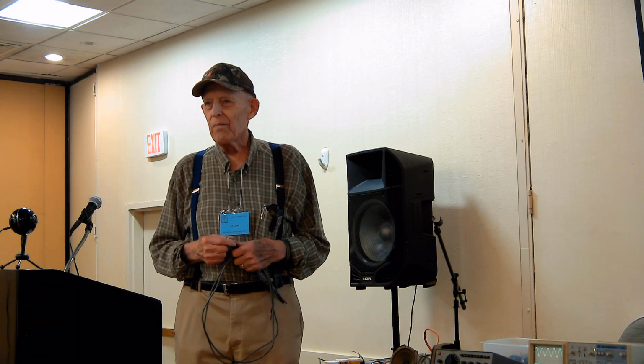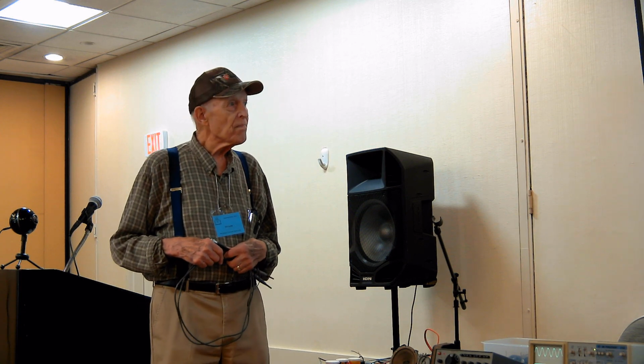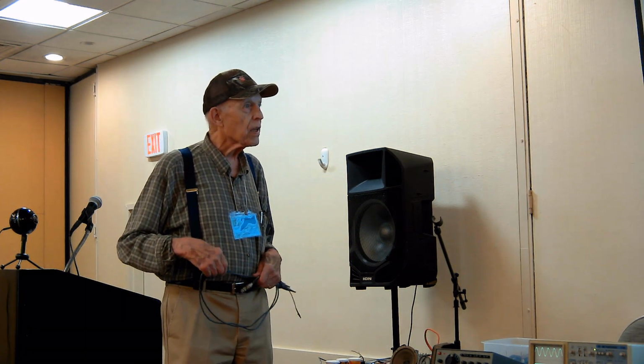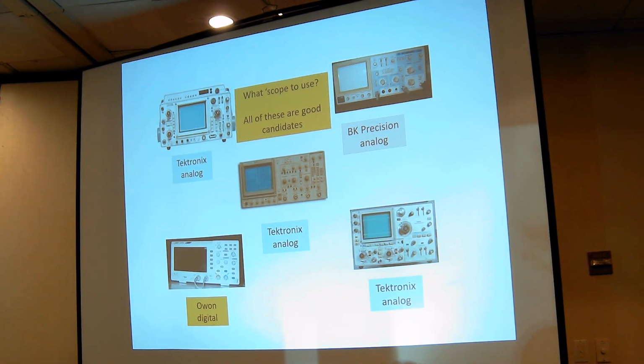Okay. Ed, I noticed on that slide, can you bring up the slide again, Dave? Sure. You don't have HP as one of the brands? No. One of the problems with buying some of the early HP solid state units was they were storage scopes. And people will try to unload one of those on you first before they unload a good scope. And storage scopes had all the storage in the screen in the Hewlett-Packard brand. More recently, they make a digital scope now. They don't call it Hewlett-Packard, it's called Keysight, but it's the same company.